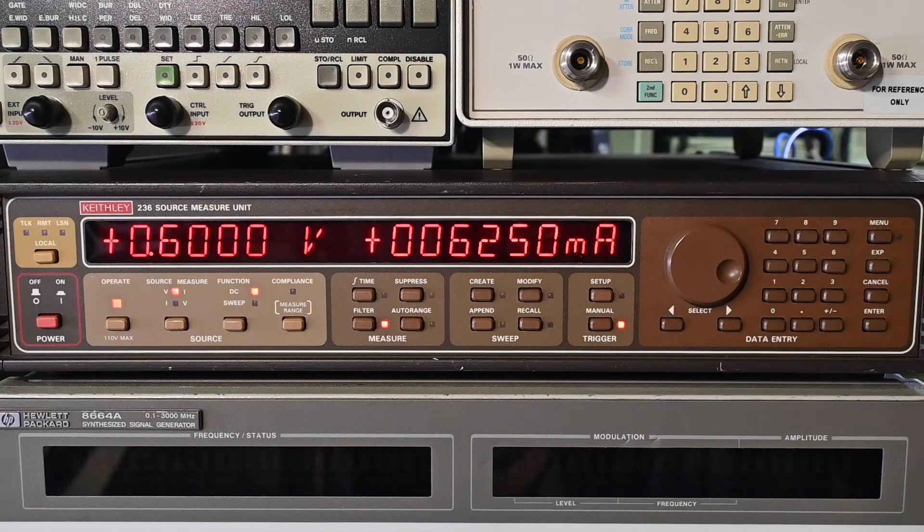You can see how the diode is performing and it matches the curve on the datasheet. A tunnel diode is quite simple to test — this is just one way they can be tested; there are other methods, but this is quite easy to do. It just takes a power supply with fine control of the output voltage, and you can use a digital multimeter in the current measurement setting to measure the current through the diode. If a tunnel diode is in the circuit or project you're working on, you can verify if it's working correctly. If you enjoyed this video, let me know by giving it a thumbs up. If you like the content on this channel, don't forget to subscribe — there'll be many more videos coming up, lots of projects in the queue. Don't forget to tap that bell symbol to be notified when I post a new video. See you next time, goodbye for now.